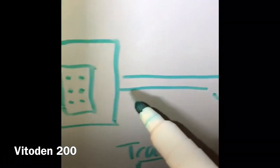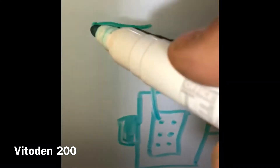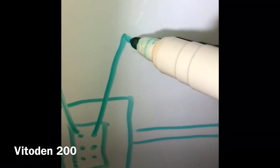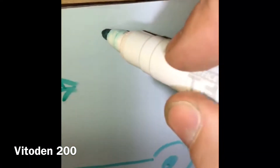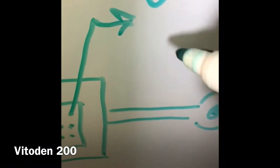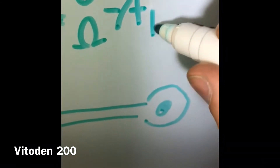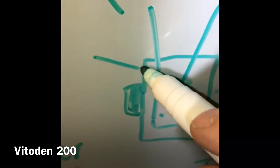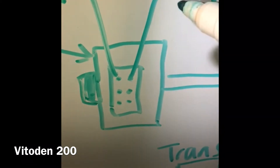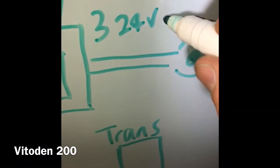I've drawn it for you already — there's the stepper motor. You've always got three at the back and three at the front. That takes the motor one way, and that takes the motor the other way. Methods of checking these: turn the power supply on and off and it'll move to the three positions, then do a resistance check — plus or minus 10%. The resistance readings should always be taken at the front of the motor. Also with these, you've got 24 volts DC.